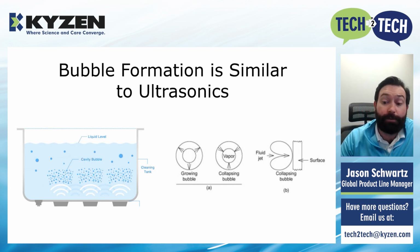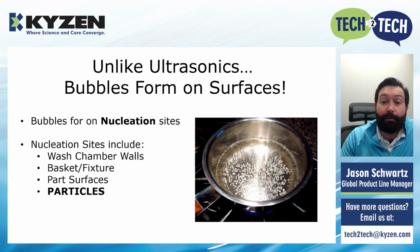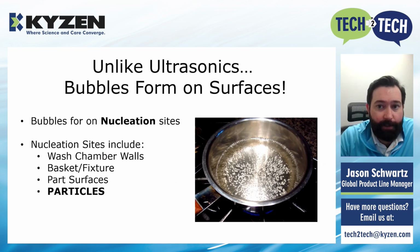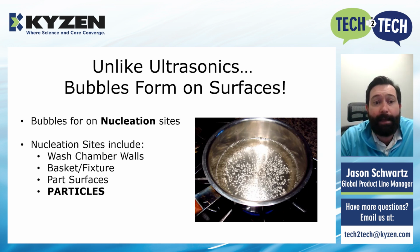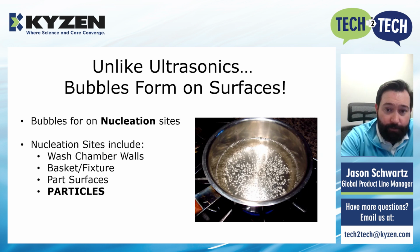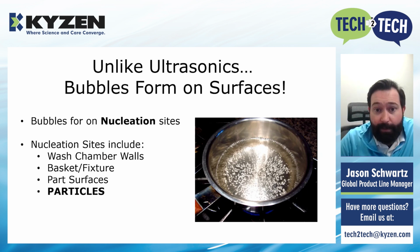But unlike ultrasonics, the cool thing about CNP processes is the bubbles actually form on nucleation sites. That's where this N, the nucleation, comes from. So what is a nucleation site? It's basically any surface where a bubble can start forming. Going back to our water boiling in a pot, you already see this happening every day. You can see those bubbles forming all around the bottom of that pot, all around the edge on the metal surface of it. Those are the nucleation sites. The same thing is happening in this CNP process.